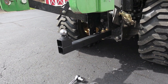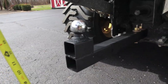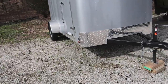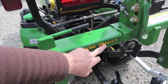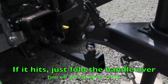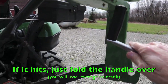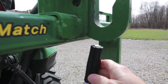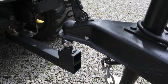It came out pretty good. I'm glad I went ahead and doubled up that tubing on top. Looks like the top of the ball is at 16 inches, and it looks like the trailer's still going to be high in the front, but not by much. One thing you've got to consider if you've got the John Deere iMatch hitch on your rear — you're going to have to watch your clearance. I'm over the ball by maybe an inch, but I got lucky because that's the clearance I'm dealing with. The iMatch is in the highest position, so it's going to be okay.